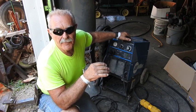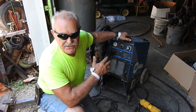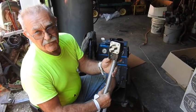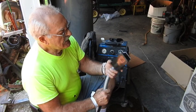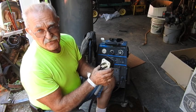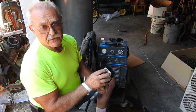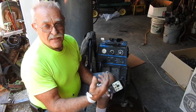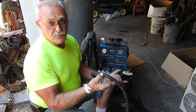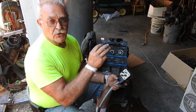You just have to make sure you go to the wiring diagram in the PDF and connect the correct wire colors on the pigtail that comes shipped from the factory — attached inside the unit — to the power supply you decide to use. So here it is, back with the original plug that was on it when I brought it up, hooked back up exactly the way it was hooked up. It's hooked up for three-phase auto-ranging — anything you want. But whoever buys it, I would suggest taking this off, verifying the wire colors according to the wiring diagram in the Miller PDF, and wiring in the appropriate plug for whatever receptacle and power supply they have — single-phase or three-phase.